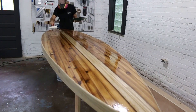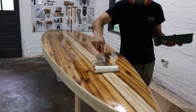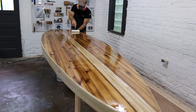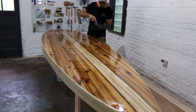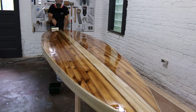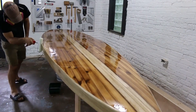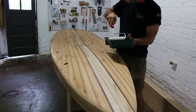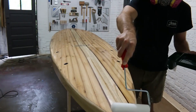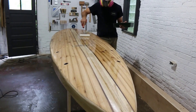I'm adding two total layers of varnish around the entire board, letting it dry for a day in between coats. If your first coat has some imperfections you don't like, you can always sand lightly with some 320 grit paper, which will also allow that second layer of varnish to bond well with the surface. If you are satisfied with that first layer, it's still a good idea to use a Scotch-Brite pad instead of sandpaper to lightly scuff the surface.